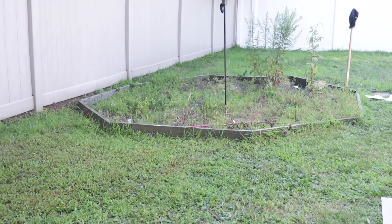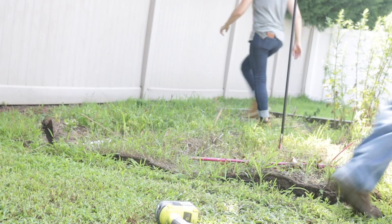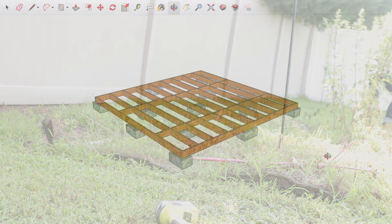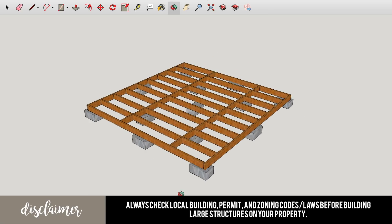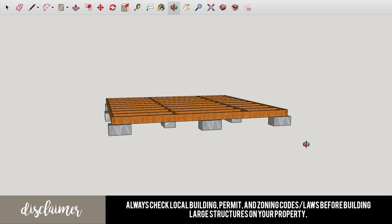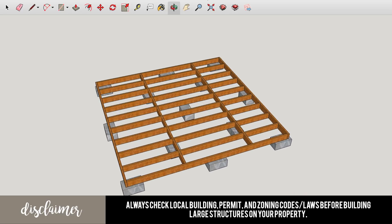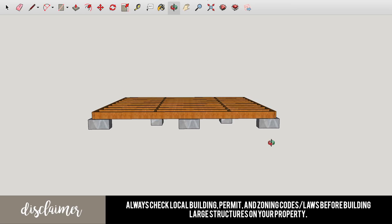At this point I organized everything and my dad and I took some time to survey the land to figure out where we were going to build the shed. After deciding on a spot behind his garage, we took some time to clear the land to prep for the actual build. As we clear the land, let's talk game plan. Where we live we cannot build anything on a concrete pad without applying for an extension permit, so we opted to build our shed on concrete blocks. This particular shed came with an optional floor plan recommending pressure treated 2x4s at 16 inches on center, but we upgraded those to pressure treated 2x6s and added some extra bridging for floor support. My recommendation for anyone looking to build their own shed is to check with local code about what you can do in your own backyard, because this will dictate the build.